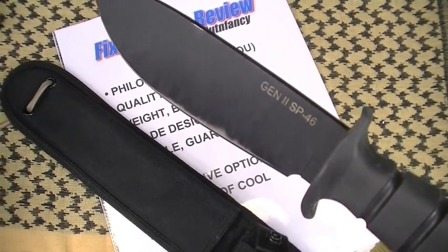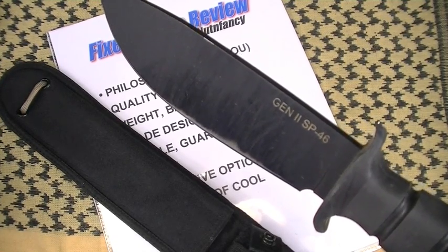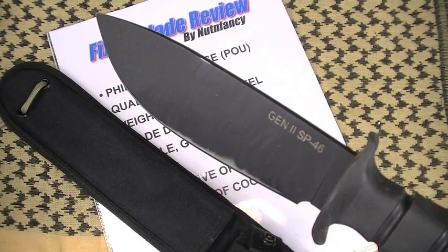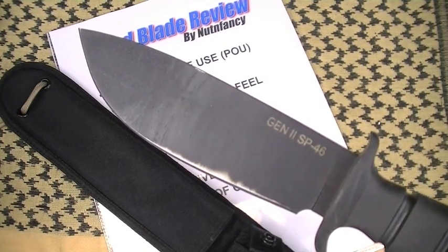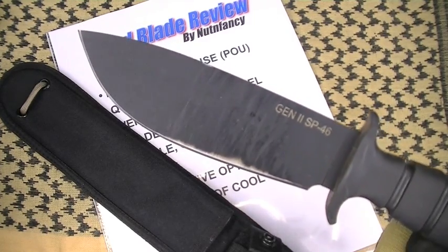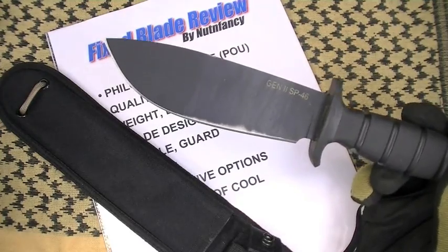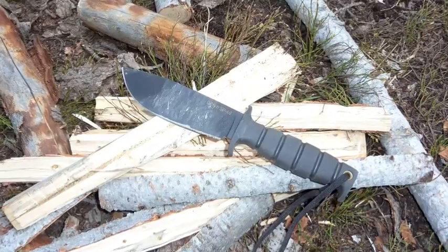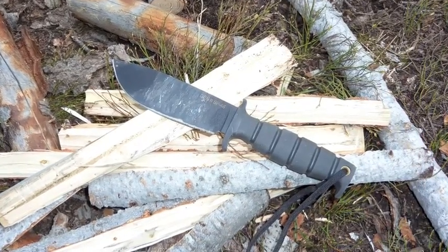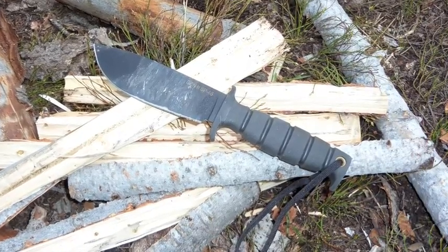Water jet cutting. The blade blanks were cut out of the plate using a water jet cutter rather than a laser cutter. And he talks about how with laser cutting, it can actually heat affect the steel and affect the tempering, maybe induce some cracking when the blanks are being cut. Stress relief. This is fascinating. I introduced a vacuum stress relief operation after cutting to eliminate any residual stress that might cause straightening or other problems due mainly to coil memory. Huh, that's cool.